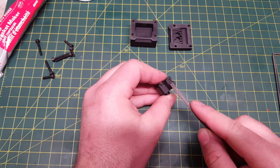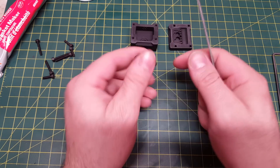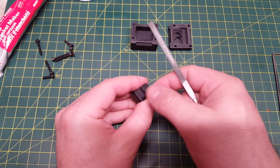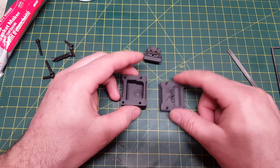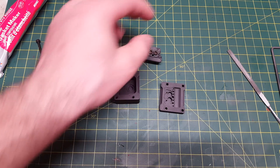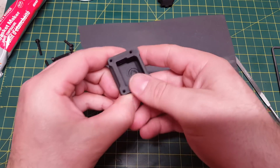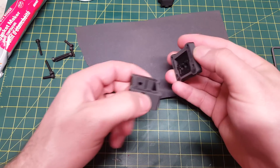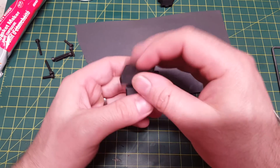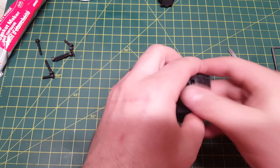On these two ends here, these are seal-off sides, which means they seal off on the vertical wall. This is where your heater and thermistor will come out, so you don't really want to take too much stock off those ends — just take off that little lip so it's nice and smooth. For the other halves, they're printed in a different orientation so you shouldn't have to clean the edge, although I do recommend taking some high-grit sandpaper and running it quickly so the tops are nice and smooth. Because these two clamp together, and if there are any bubbles or high spots of plastic, when you close it, it won't make a perfect seal and you'll have a knit line all the way around your finished sock.